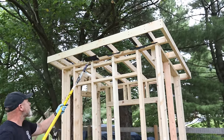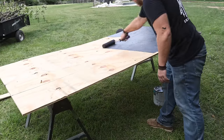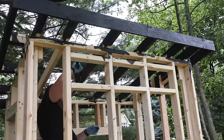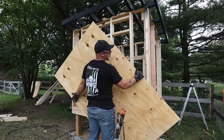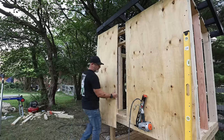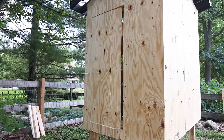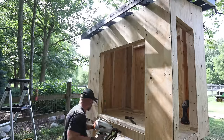I also painted the fascia, the rafters, and one side of a sheet of plywood that's going to show on the inside of the roof. When I built my shed I didn't do that and always said I'd go back and paint it later, but once everything was sheeted it was more difficult to get into those roof rafter spaces. So this time I'm painting it all while it's exposed so that when I install the windows all you'll see is black through there. For the sheeting I'm using 3/8-inch plywood on the walls and half-inch plywood on the roof, plywoodding right over the openings and then going inside with a Sawzall to cut them all out.